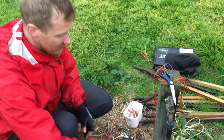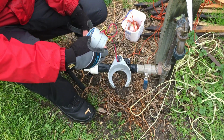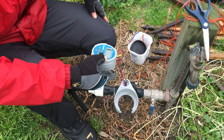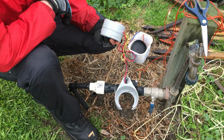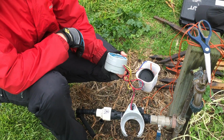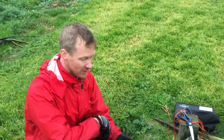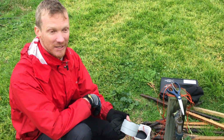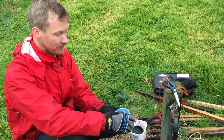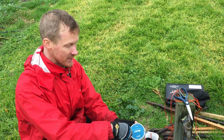Anyway, under here we've got an automatic remote node made by Hunter, but they're made by all sorts of different companies. We tend to use these around the nursery as well, and while I'm not spruiking for these guys, I have found them to be quite good. Not necessarily the most intuitive device, but certainly very robust. One nice thing is that they've got two 9-volt batteries in the back, so when one goes, the other one takes over, which is nice.